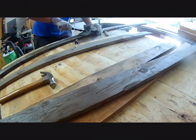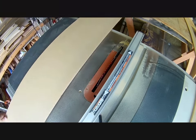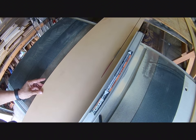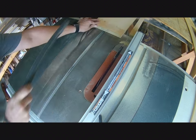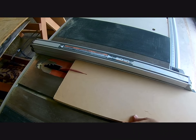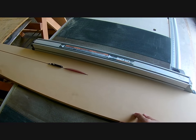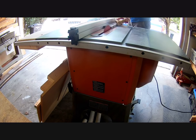Once all the hardware was removed, I had some nice wood to work with. Using some MDF I already had in my shop, I cut out two-inch wide strips that would eventually become the frame to hold the whiteboard and corkboard. The MDF was three-quarter inch, which left plenty of room for the rabbets I needed to cut later. One strip ended up a little wider than two inches because it needed a rabbet on both sides, as it would be the brace between the corkboard and the whiteboard.